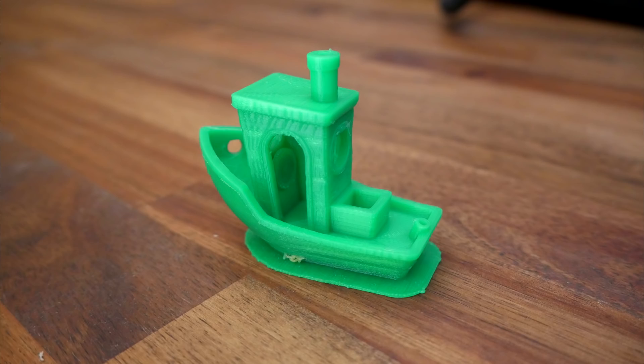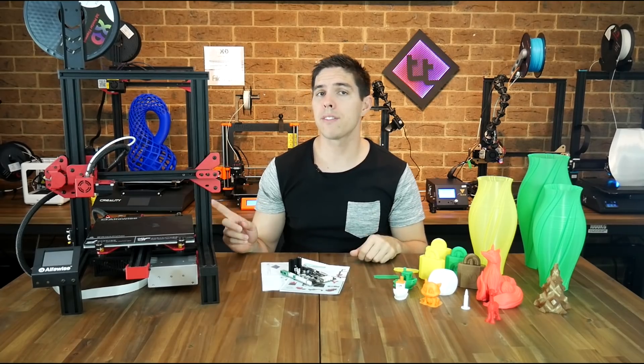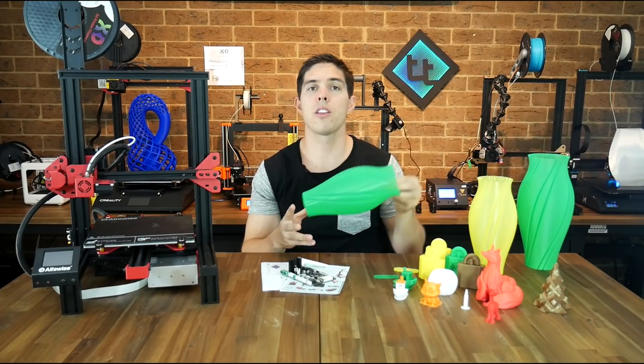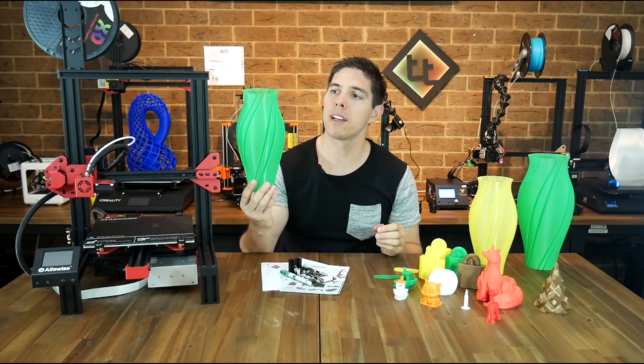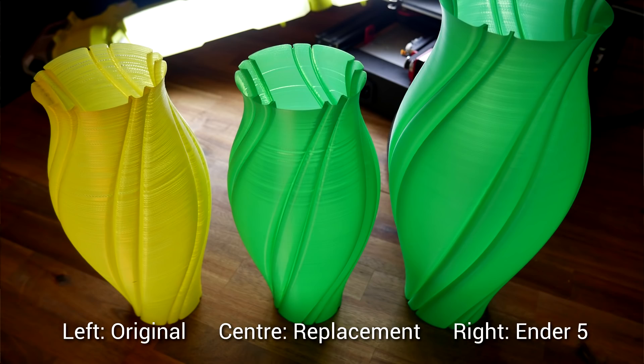You can see some subtle zebra-skin artifacts, and there's definitely still some Z-banding on parts of the boat. The best parts of this boat are quite good; the worst parts are quite average. I decided to give the printer another chance and printed a second Benchy. Although it was a big improvement on the first time, it's still not the best print — there are still sections of under-extrusion, and there's really prominent inconsistency along the vertical Z-axis. Holding a light behind the test prints from this printer versus the Ender 5, you'll see just how much better the Ender 5 print is, although of course it's not perfect either.